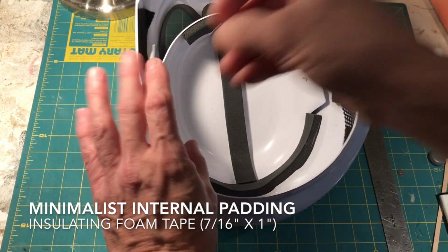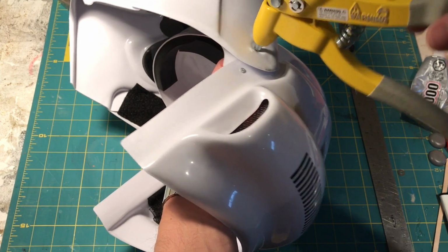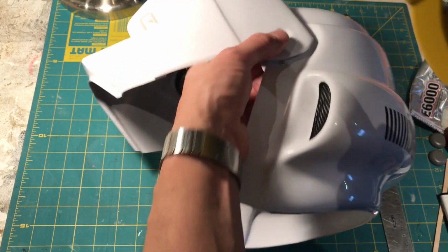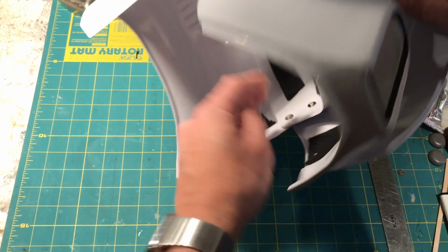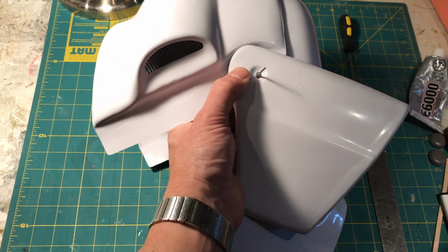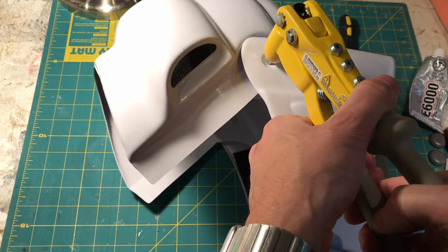So at this stage, I'm now going to be able to take that steel and rivet that down. That creates just the amount of tension that you need between the parts. I use an aluminum rivet, those long ones. The steel ones will pull too hard. They're harder to break the shank off, and that pulls in a little bit too tight. You really don't need that kind of strength in your rivets when you're working with components that are made out of ABS and plastic. It's not really that kind of a connection that we're making here.